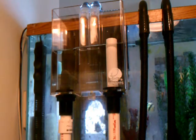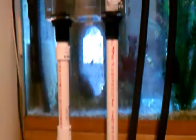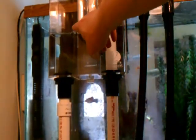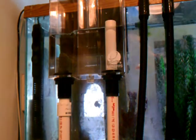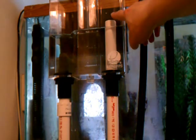We're back. I have put some water in the sump, filled it up to the bottom of the lip of the overflow to the drain compartment or pump compartment. I've adjusted the gate valve so that the water coming over the divider here is above the entrance to the drain pipe. As a result, the drain makes no noise and the emergency overflow is here.